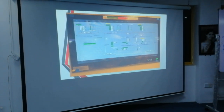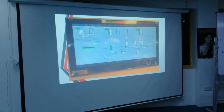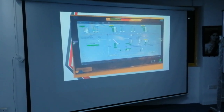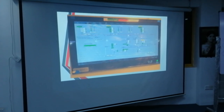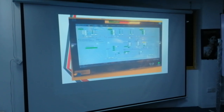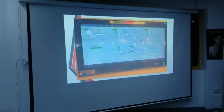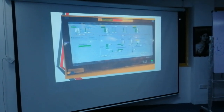Right, this is the genset mode. So these are actually very flexible. With these two clutches here, you can play around, you can use your battery. You can set it to use the battery as much as you want, reducing the running of the generators, and then you can use the shaft generator and the batteries to power your hotel load as well.